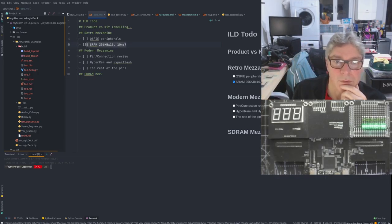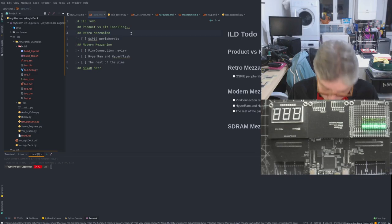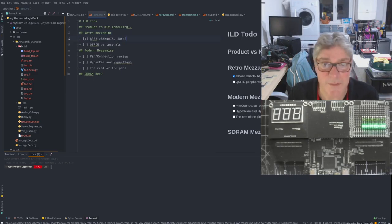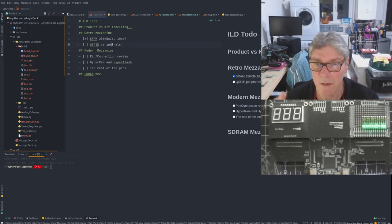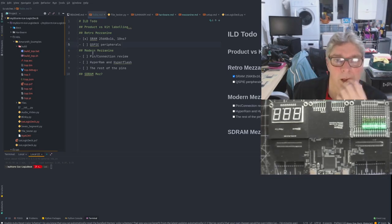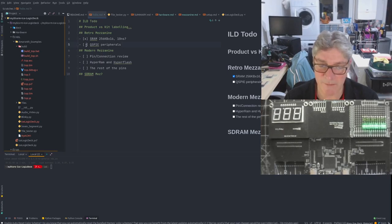which takes me on to the second part of that conversation, because that meant we'd have to run the UART over QSPI. For those that may have missed some of the early stuff, it's basically a quad SPI link, the umbilical link between the STM32 and the FPGA. We can use small packets over a very fast nibble connection effectively.